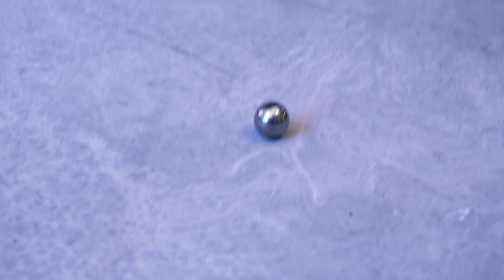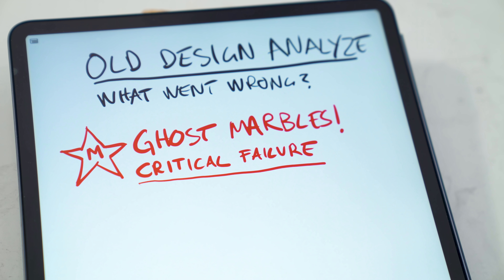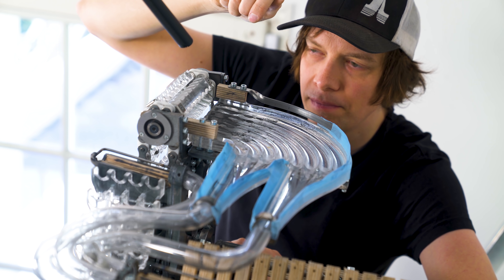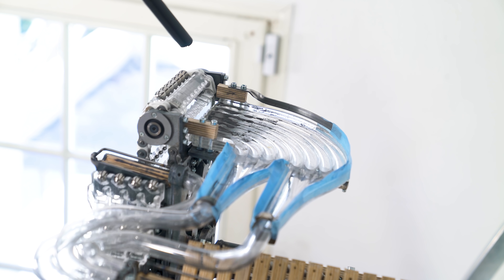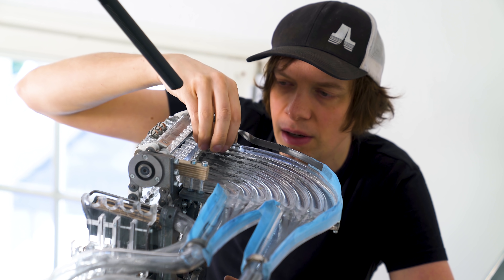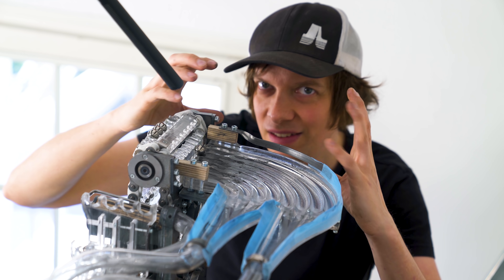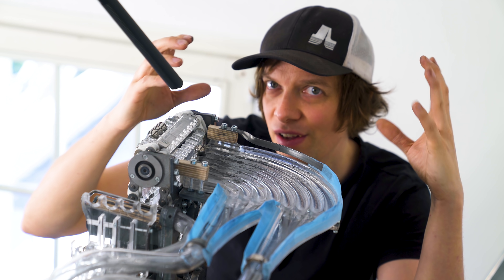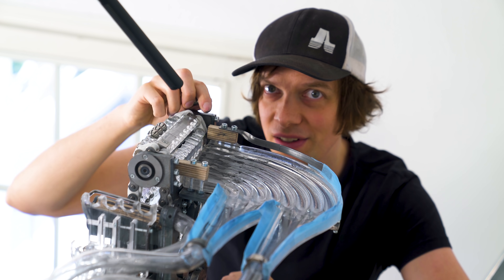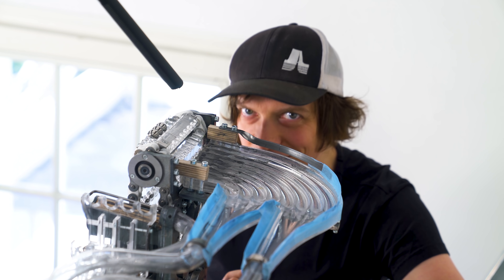When I discovered this I was kind of happy because it's a perfect explanation — I think all the ghost marbles came from this conveyor belt critical failure. The next issue is that the marbles make a huge sound when they're being dropped off. I tried to fix the audio issue by adding silicone here, which dampened the sound, but I think it was the silicone that caused marbles to get stuck, leading to the critical failure. So that's a great example of a design that's not free from moles — I whack down one mole (the audio issue) and up comes another mole (the critical failure). That's why I'm so excited today with a new chance to make a mole-free design, not playing whack-a-mole engineering on this part anymore.